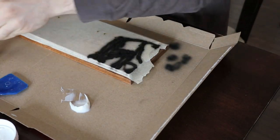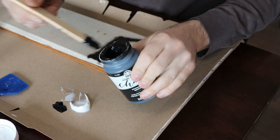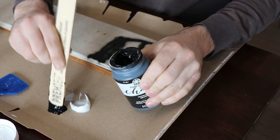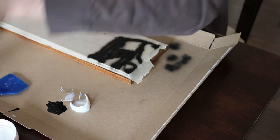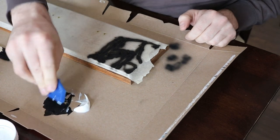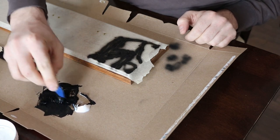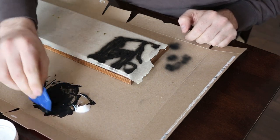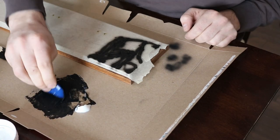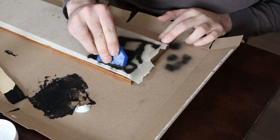So here's me adding a gel thickener to my paint. Basically, what I found is if I just apply a normal coat of paint in the engraving, the laser is making a square engraving, it cuts straight into the wood. And so you don't get that little bevel that you typically get if you use a CNC for doing the engraving. So when it's relatively small lines, I find that thickening my paint gives me exactly that.